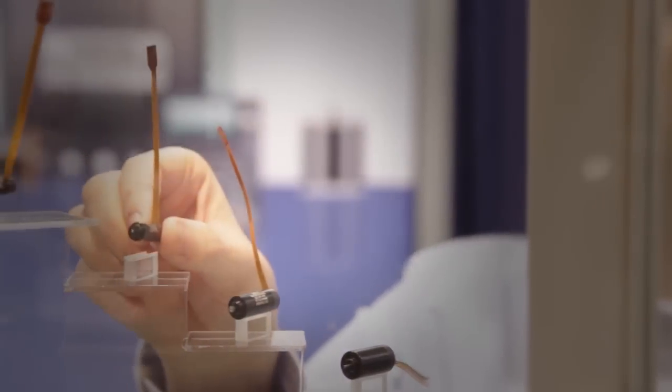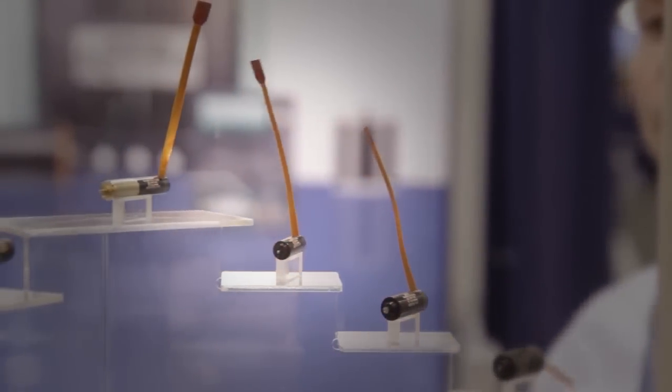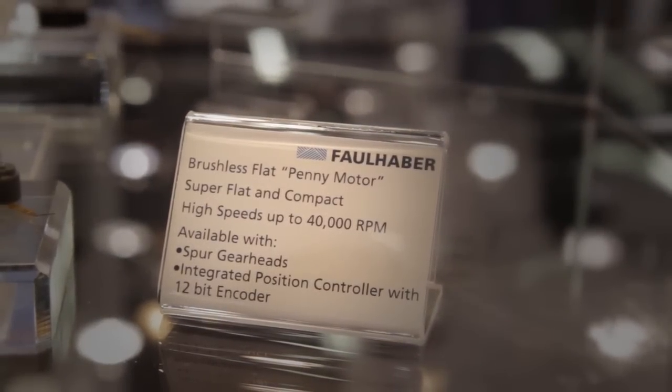What's fantastic about this addition to our brushless DC motor lineup is you can add gearheads to both of these units — both the eight and ten millimeter. It increases the torque and also reduces the speed. Some customers don't want high speed, and the only way to get it down to one RPM or half an RPM is to put on gearheads. It's fantastic that we can accommodate our customers in that way.